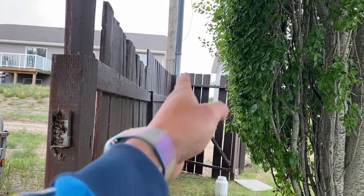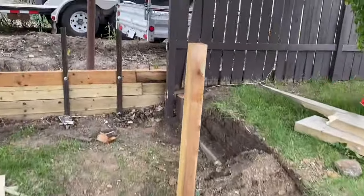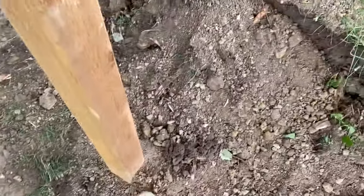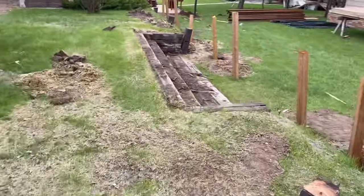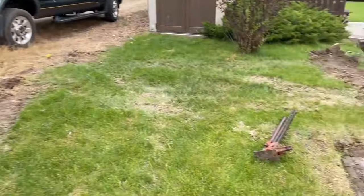We're going to bring the fence just slightly inside the power pole, move it in a bit because the neighbor is also building a retaining wall so it'll be pretty close. The retaining wall will be about two feet high. These are the shortest posts I could get so they'll have to be cut a couple feet. We're packing them in with gravel so they're nice and solid — just got a couple yards of gravel in the dump trailer. There will also be a staircase about half the width, eight feet, which will correspond to a gate in the fence.